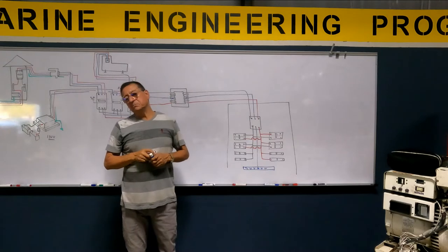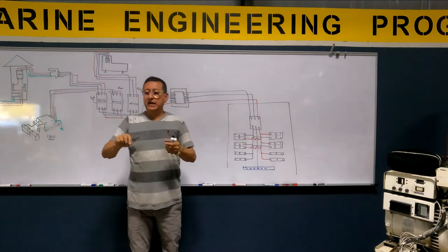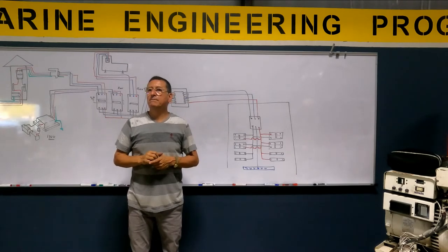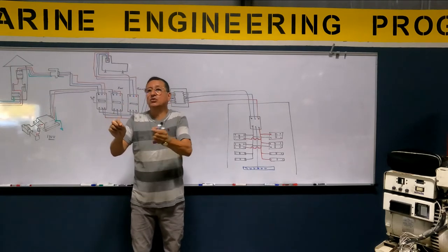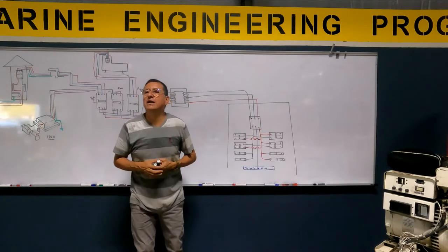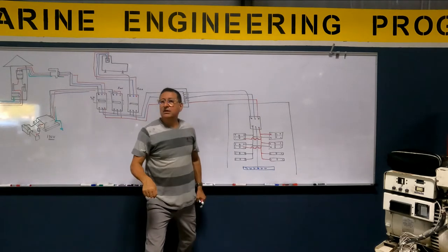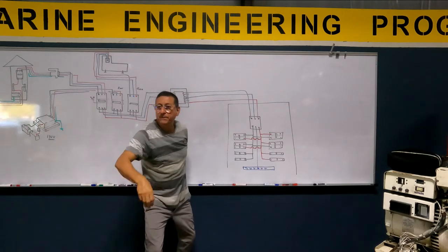Okay, somebody says, no, I am going to, because I am intelligent, I have one phase, I am going to split the cable in two cables, and I am going to connect phase one and phase two. Is that good? Does the motor of the compressor start with that split cable? Yes or no? The motor needs two phases, and you have one and you split it in two. Does the motor start? No. The motor is humming but does not start. Why not? Because it's the same phase. You remember when I did the explanation about the motor with two pistons? One person over there and another person here. Should be two different people, not the same person with both hands. Should be two different persons moving the crankshaft.